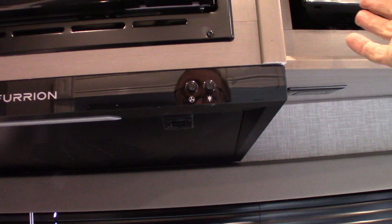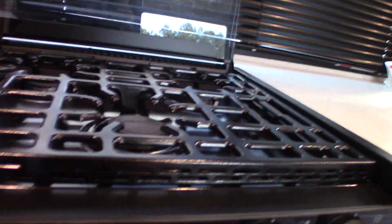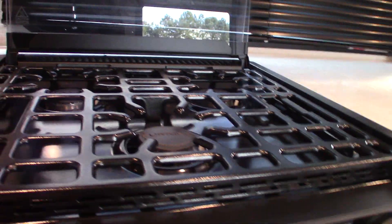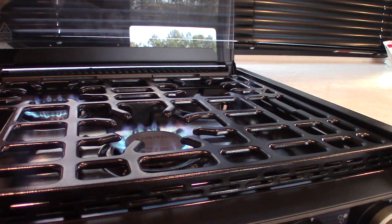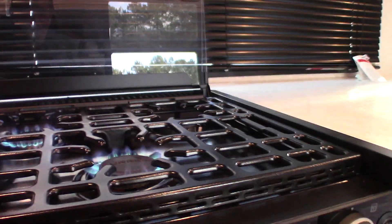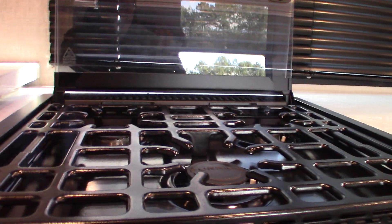Your microwave works like any other microwave. This is your range hood — remember about opening the baffle on the outside if you're going to run the fan. Your range here — it may take a moment to get the gas up because we had disconnected the tanks and then filled them up, so there's still a little space of gas line that had air in it. It had to work past that bubble. But once you do that, it'll light on the first click every time. Just keep that in mind when you change out tanks — there'll be a little lag time until it kicks on.